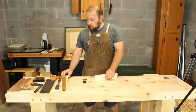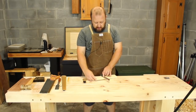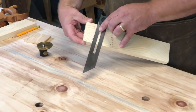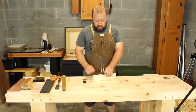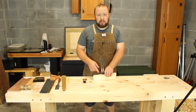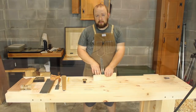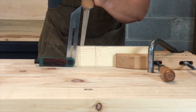In order to open the mortise, we choose our angle and draw it on as a guide. You can use your bevel to pare the ends of the mortise at an angle to open it up a little bit and give you room to put the wedges in. To flare the mortise, I re-chop the ends using a bevel to guide the angle.